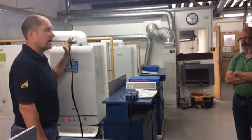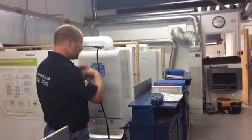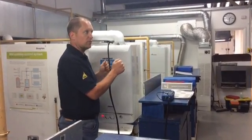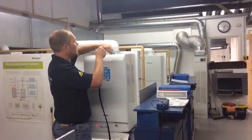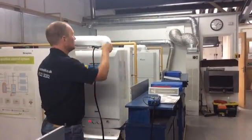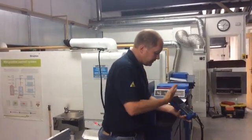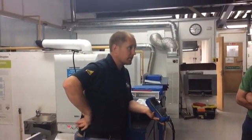It's already in maximum mode, so what I can now do is take the probe straight out and put it into the products of combustion test point. The boiler's already running and already firing up, so I'm not going to flood the analyser with high levels of carbon monoxide. I'm going to take that one out, same thing — all the way in, stopper in, withdraw it a little bit, and put the oxygen probe straight back in. We can see readings coming up on the display, so we're going to let that settle and stabilise.